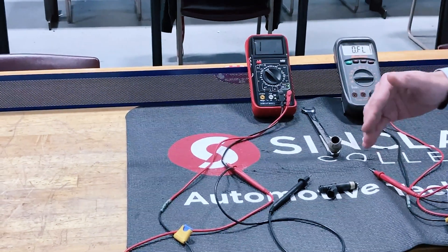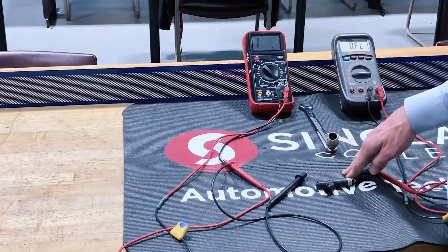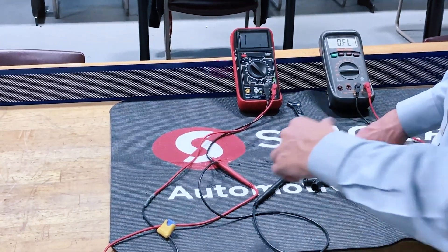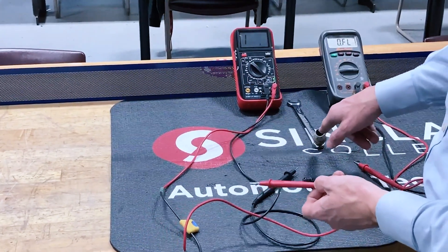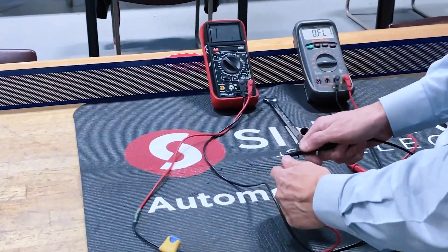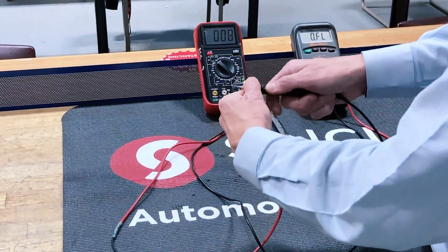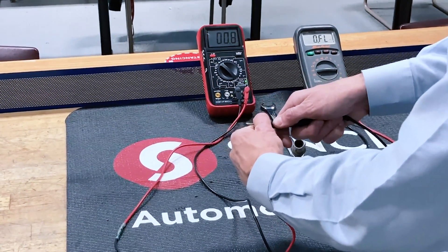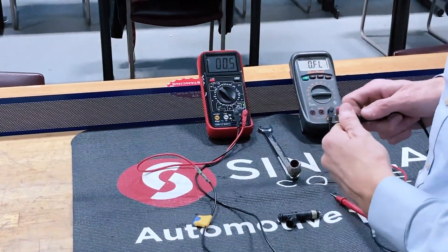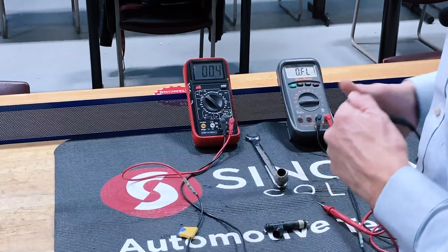You're basically selecting the range that the meter can read. We have a temperature sensor here, and I know what the resistance should be. We might want to measure its resistance to compare it to a temperature chart. We'll take our red lead and our black lead — two leads — and check resistance. We make sure they don't touch, because if they touch it will show low resistance. Right now we're checking the resistance of the meter leads themselves, which should be under about one ohm. We're getting about 0.8 ohms — that's the resistance of our wiring and connections going into the meter.